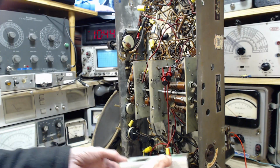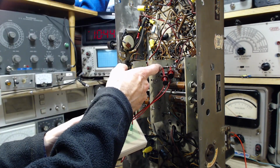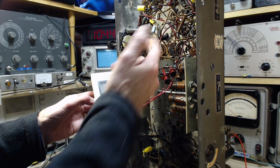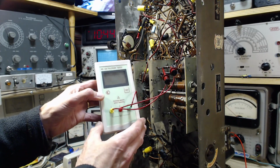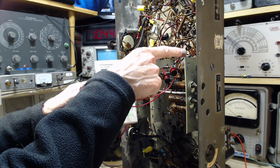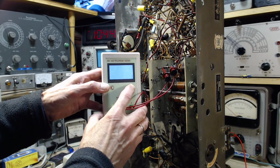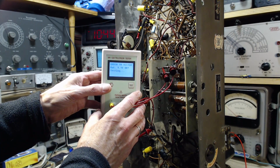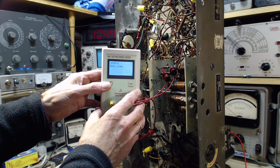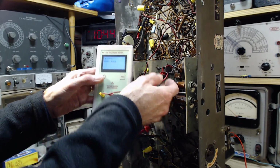I spent a lot of time out of the shop this morning, but I came in and thought, you know what, I really should change these resistors. I'm pretty convinced they should be 33. For reasons I don't recall, I put a 39 in there. What does it actually measure? It's still in the circuit here, but one end of it just goes to a capacitor, so I can read it like this. It's supposed to be 39, and it's 42. It's supposed to be 33 in fact, but it's 42. Wow, that's really a significant difference.